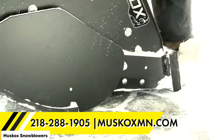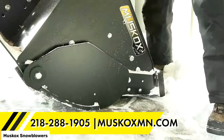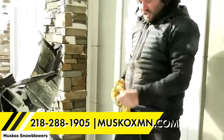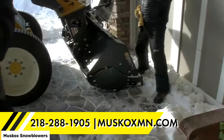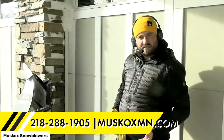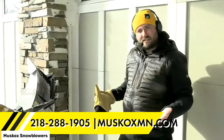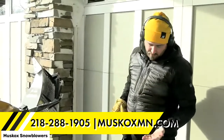For you guys that operate Bobcat Toolcats, that have the single arm for the hydraulics, when you rotate a Bobcat Toolcat, you end up naturally right in this position when you extend it out. So we've got a lot of Bobcat Toolcat customers. Very common question. Works great with that machine because it rotates right into this. When you get a skid steer, you can rotate it more, but that's not the ideal spot to be in. This is the ideal location and what you're paying attention to be able to back drag.